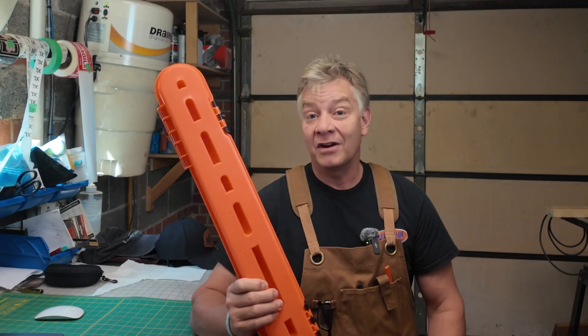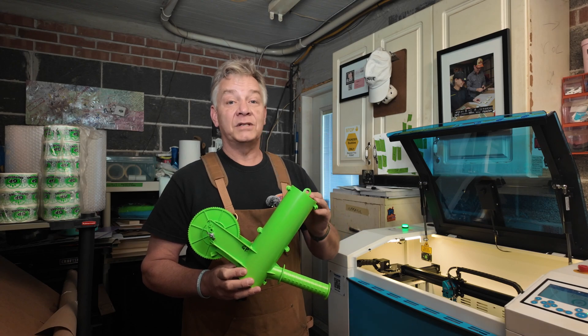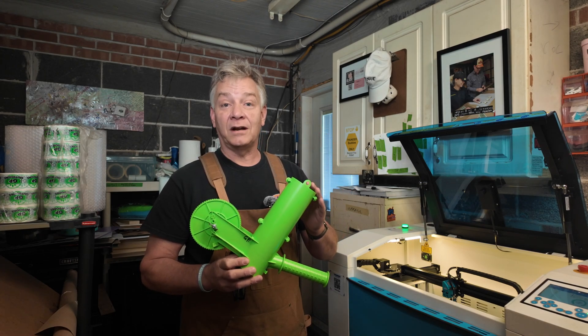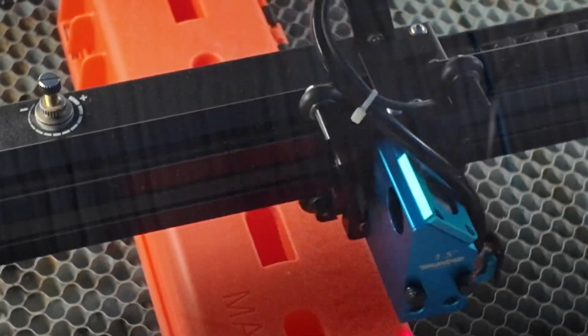Don't rely on what you read on the internet — try to get the safety data sheet on the particular plastic that product is made of before you put it under the laser. So let me tell you what it was like engraving plastic. You're gonna find that plastic engraves very differently than a lot of the other materials we've done so far on this channel. Plastic melts easily, so some suggestions I might offer: because it has such a low melting point, you want to start off with a very high speed.